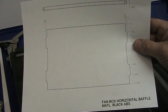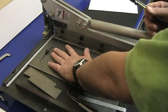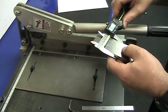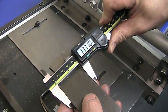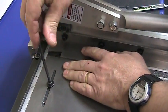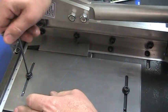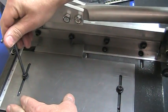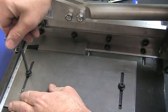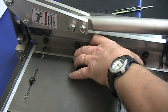I'm cutting pieces for the fan box out of 1/16th ABS using the shear. I've made a fence on the left side in between the blade, which makes it easy to set your actual width of cut and constrains it. I'm using the adjustable parallel — I'm after a 1.770-inch width of cut. With the blade down, I can come in and set this snug, check down at this end to make sure it's actually parallel, slide up to the other end to make sure we're getting a good seat on the blade. Then we'll just lock these up, and that sets the actual width we're after.